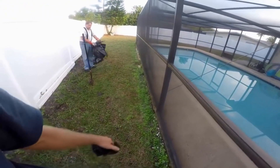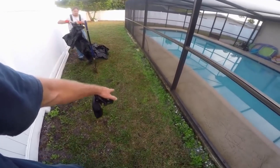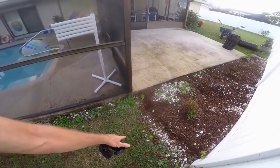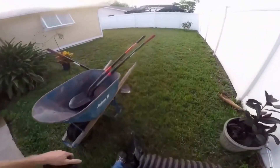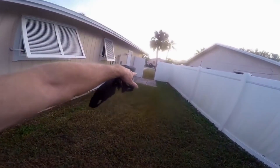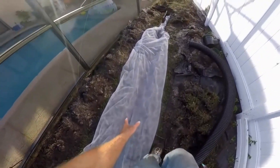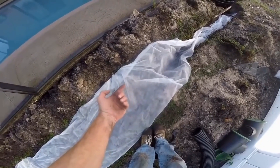This is why you need to put a typical drain in. What we're going to do is put a French drain with a couple of catch basins. A French drain is perforated pipe surrounded by gravel — we're going to encase that in fabric. That will run between here and back where Dan's laying out the tarps. We're going to put a sump pump over here because this is Florida and it's very, very flat to send things out to the street, so we're going to actually lift the water up. A long discharge, but the good Zoller M53 will easily push this water around. It'll go out to the front yard — we're not going all the way to the street because there is fall after you get past the fence. So we have our trench dug for the French drain. Now we're going to lay some geo fabric down in the trench, then set some gravel on the bottom, our perforated pipe, more gravel, and then cover that with the fabric.